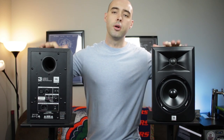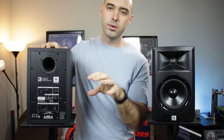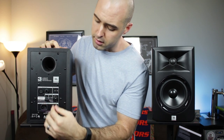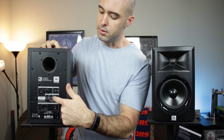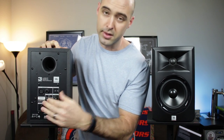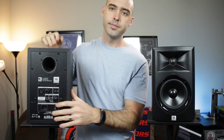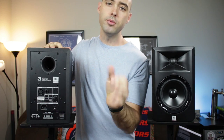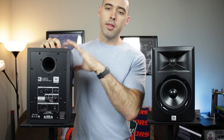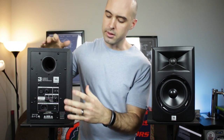When you're adjusting the volume on a powered monitor, you generally feed the signal through a preamp so that you can control the volume from there. That adjusts the signal going into the speaker, so you set the max amplification you would like. You don't want to set an amplifier all the way up to its highest volume because you can get distortion and clipping — you want to leave it between halfway and three quarters. I like to adjust mine to where, when I set the volume on my amp to something that's comfortably listenable for my headphones and then turn on the speakers, that same volume is about the same comfortable listening level.